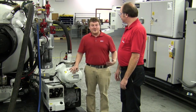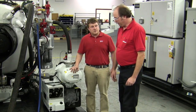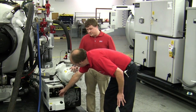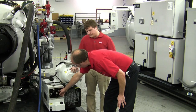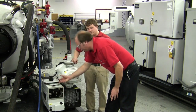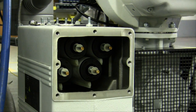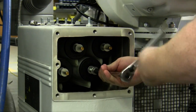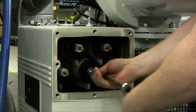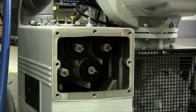Now that we've removed the exhaust flange, we're going to take a look at replacing one of the exhaust filters. All we're simply going to do is remove the brass nut on the bottom right-hand exhaust filter. There's a washer, a spring, and another washer — take those off, then just pull the exhaust filter out. I'll get my wrench — that's a 10 millimeter deep well. Just loosen the bolt all the way, and then we can pull the whole sleeve out.